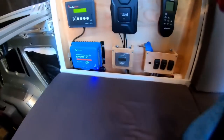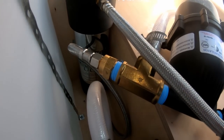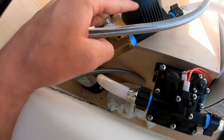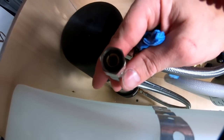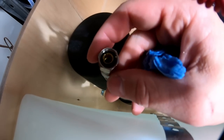I'm going to turn on the 12-volt water pump via my switch panel. When I flip this switch I'm not sure exactly what's going to happen. There's a little bit of dripping — I have a leak at the T connector and at the connection to the pump. The fitting at the bottom of the water filter also had a really slow leak. Lesson learned: you don't want to over-tighten compression fittings — I shredded the seal by over-torquing it. You want to get it firmly hand-tight and then maybe three-quarters of a turn with a wrench.